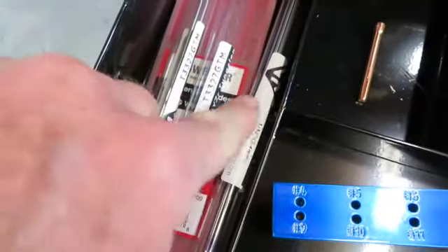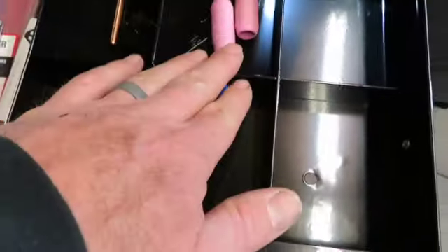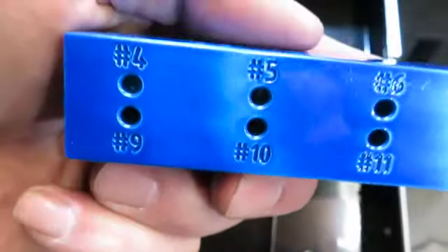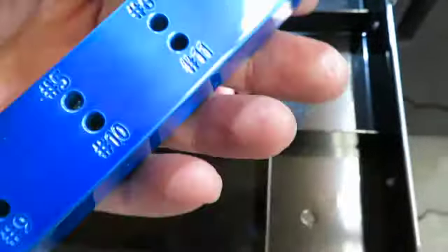As far as storage, this tab right here — I just bent it back and forth and broke it off. Nice place to keep all my tungstens right up front. Got some collets, some nozzles, some end caps back there. I also picked up a stick-out gauge for your tungsten — for your cup size it starts with a four and goes to a 12, and it also has the feature to break the tungsten off. I did pick this up on Amazon and will put a link in the description. You don't have to guess for your stick-out on your tungsten.